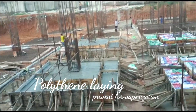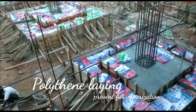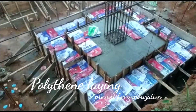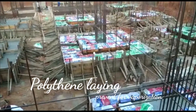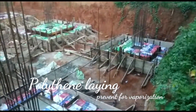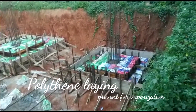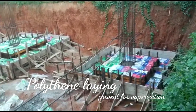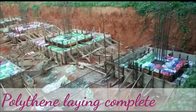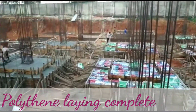The shutter is fitted using external rods which are welded from the bottom layer of the footing rod. We use a fully thin polythene sheet for prevention of vaporization from the top surface of the concrete, because with RMC, cracks can develop on the top surface. For this reason, we use a small curing cover laid over the full surface for prevention.